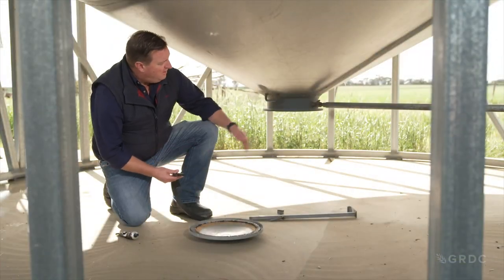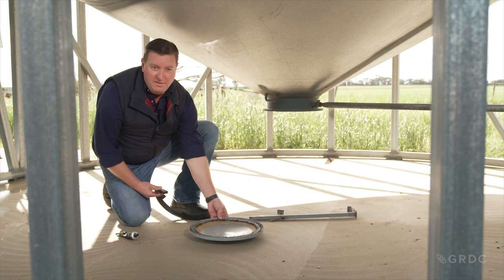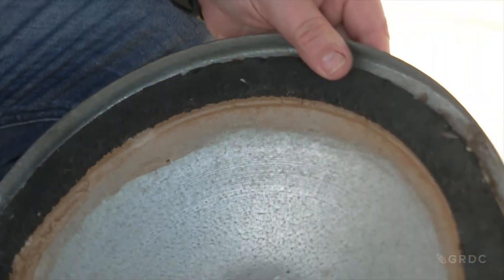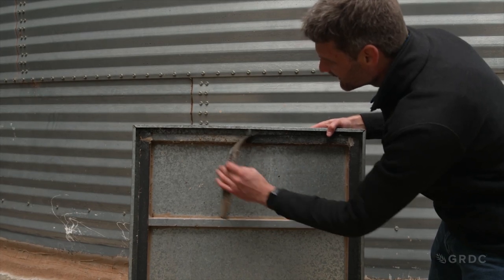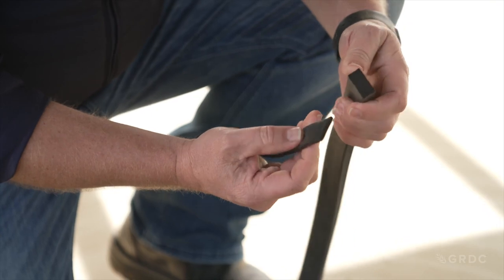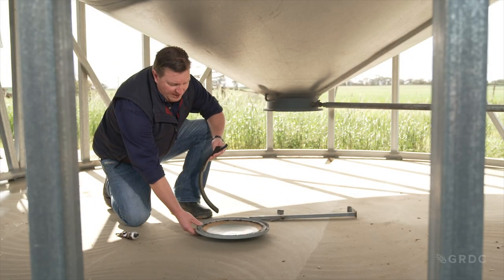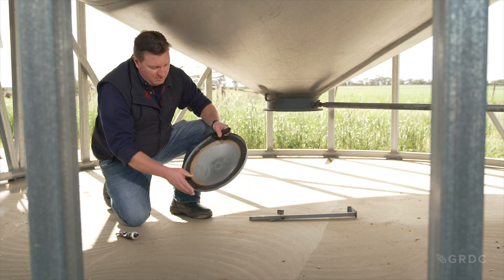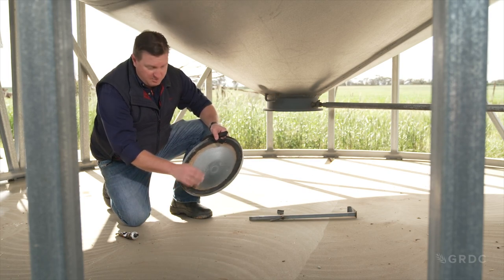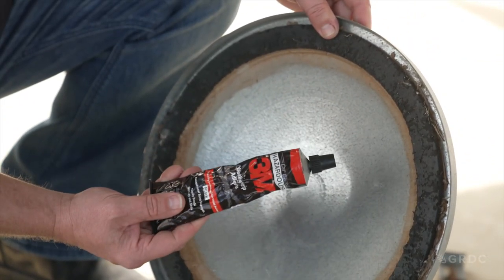At the bottom of the silo, the outlet, the outlet sealing face, and the seal on the sealing plate that might go on that outlet are also prone to damage and can be replaced. Also, the access door is an obvious place to look for seal damage. Those seals can be replaced with a closed cell rubber foam like this one, and they're pretty easily taken off the old sealing plate with a scraper and then fixed with an adhesive like this one.